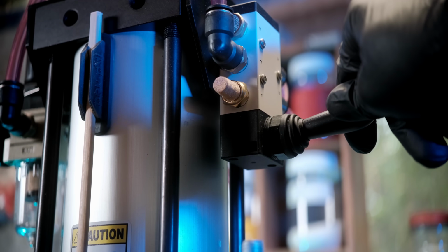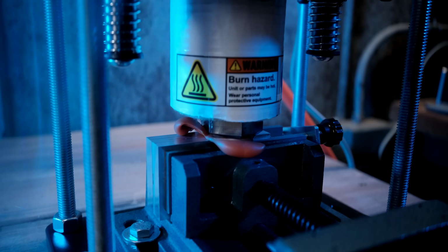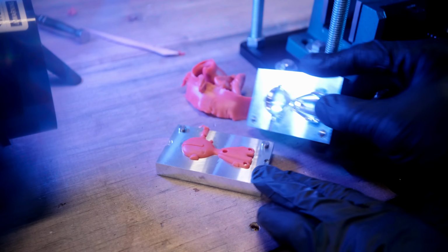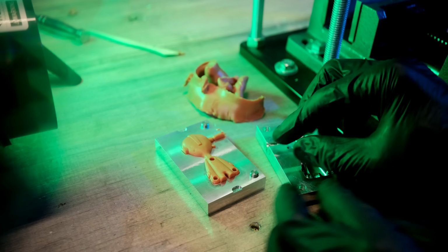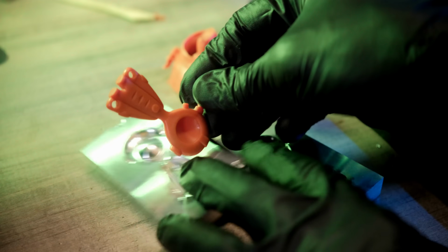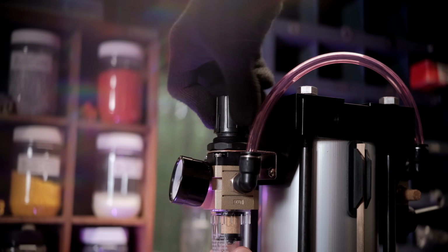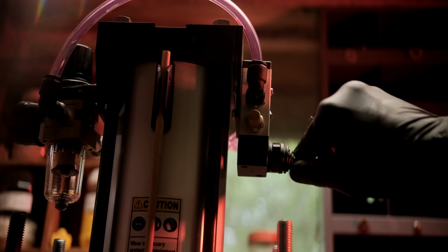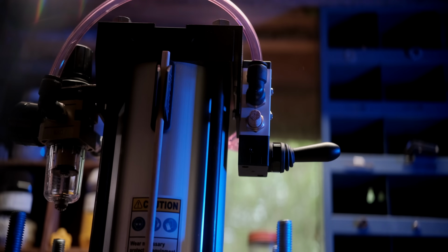Without changing any settings, let's go ahead and just try to get us a, all right. Well, maybe we'll turn down the pressure just a little bit, but honestly, seeing all that plastic is actually encouraging because that means we could do bigger parts if we want to. Let's decrease the pressure and add some hold down time. This keeps the plastic cooling under pressure to minimize shrinkage.